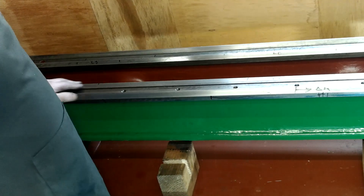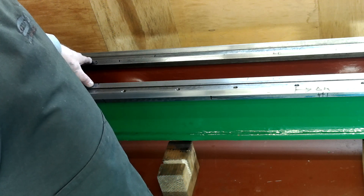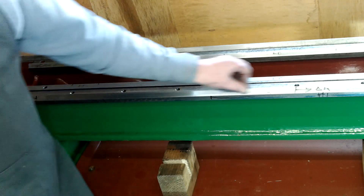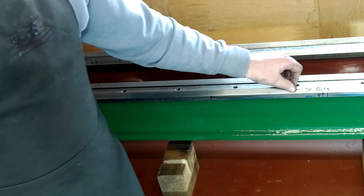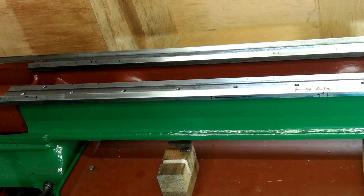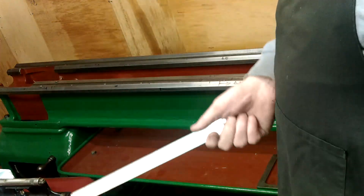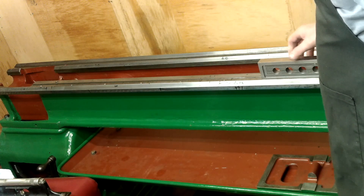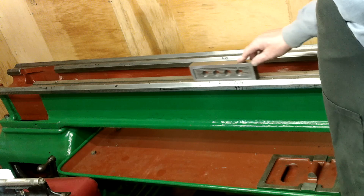So far I've come to the conclusion that the saddle slides are in need of repair and that I've got three faces that from the straight edge point of view are in good order. While looking at the possibility of using the tailstock slide for gauging purposes I made a surprising discovery. Both recesses are one inch wide — not really that remarkable — but I've got two parallels and they are one inch thick, well four tenths of a thou under, but to all intents and purposes one inch thick. They fit in the recesses beautifully without play and yet they slide back and forth with very little friction.